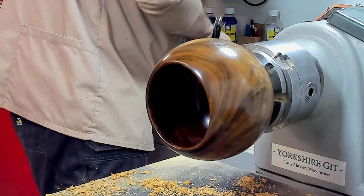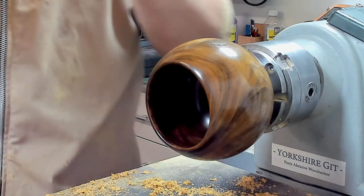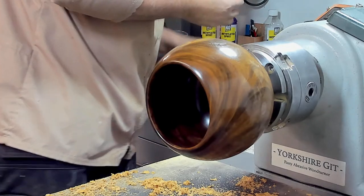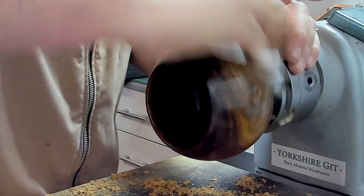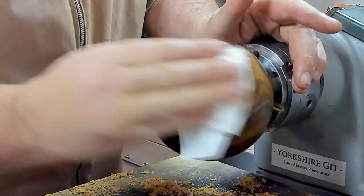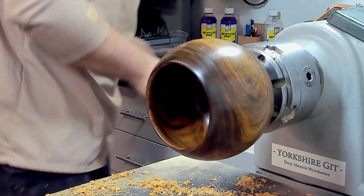But we've got to be careful we don't put too much wax on in one go, because you can still see where the grain is, like little dips in it. We don't want to put too much on and fill those with wax, because it may make it go whitey colour. So we want to put a couple of nice light even coats over it so that we can buff it off together all in one go. So I'm using Hampshire Sheen High Gloss Wax,